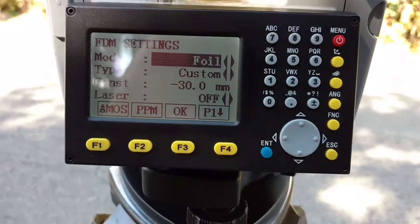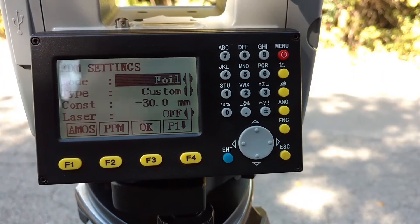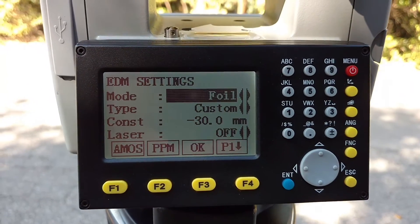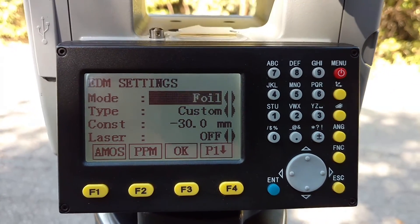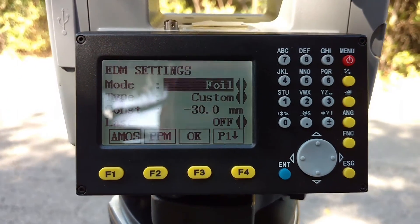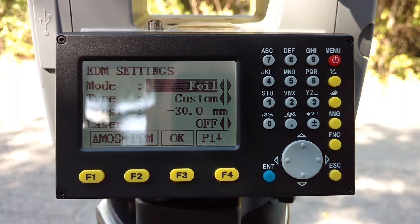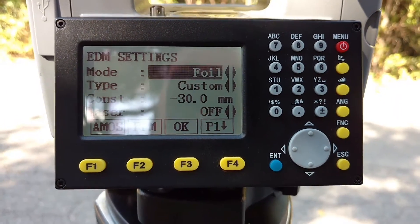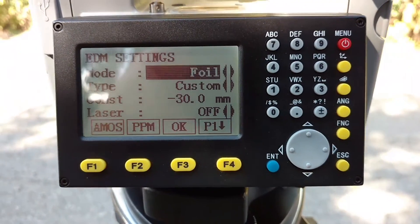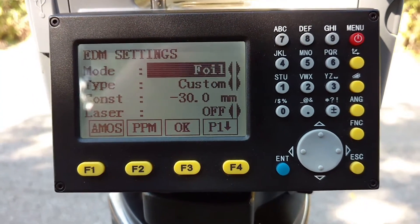Foil — I don't know if you've ever seen these, but basically you can buy these foil pieces that have a light adhesive on the back. You can buy them at different grades; they have a special face that's reflective to a certain degree. You can stick them on walls or other points that you're monitoring. It's not a long-term use like a nail or a rod you'd put in the ground for control, but you can use it for control for certain things.